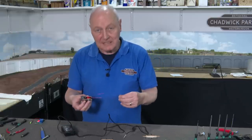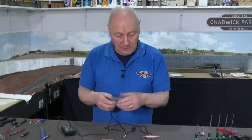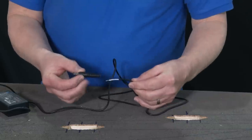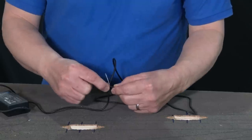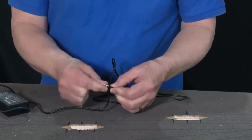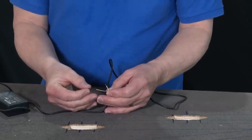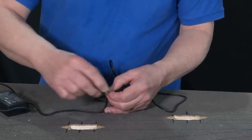Now before the bit everyone hates — the wiring. With solenoids, I make a point of not wearing my watch when working close with them, as the magnetic field can be quite strong and I'm not sure what impact it might have. I bought a 16-volt 2.5-amp power supply, which came with a barrel connector. I've cut off the barrel connector, revealing a centre core with a positive feed and a sheath around the outside, which I've covered with some heat-shrink tubing.